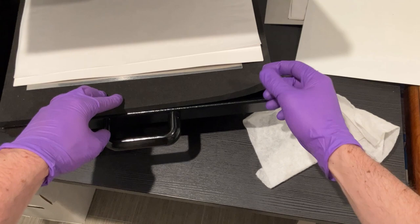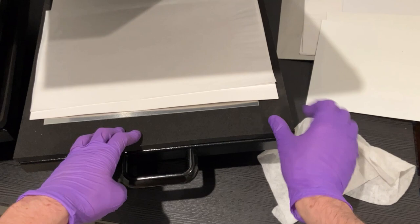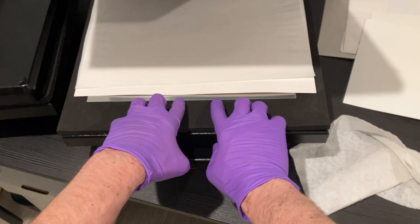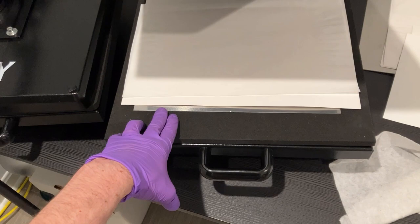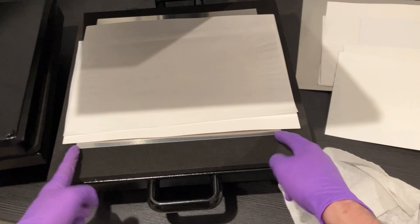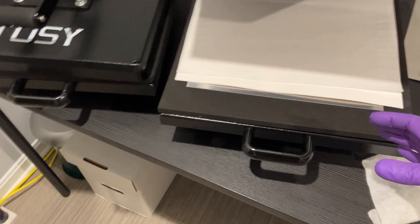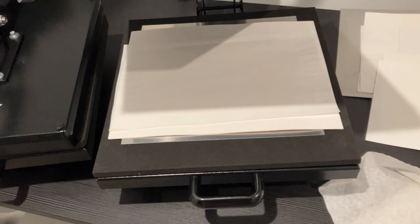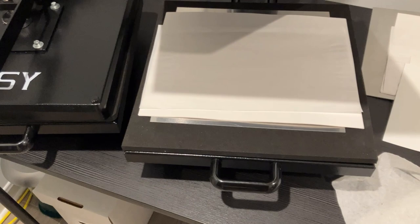Inside my press I have the silicone pad - this came with the press from the manufacturer. You can remove this if you want, but you just have to crank on the knob to adjust down. I have aluminum plates in this press. Some people in the field swear you need aluminum plates instead of steel plates because they have a different coefficient of thermal conductivity, but I actually think that's nonsense. The coefficient of thermal conductivity matters when going across a very long distance on a metal. Because the surface-to-surface area contact here is extra large, I don't really think there is a reason why you need a different metal. I've consulted engineers and they all agree that if your surface area of contact is large relative to the thickness of the metal, it doesn't really make a big difference.